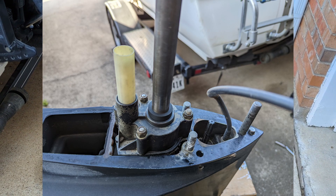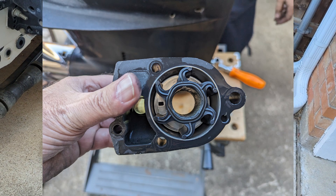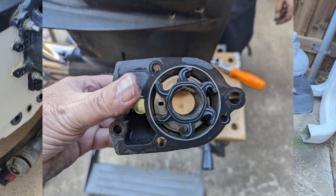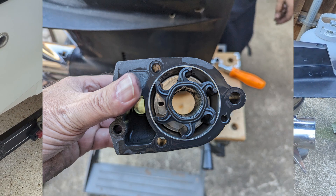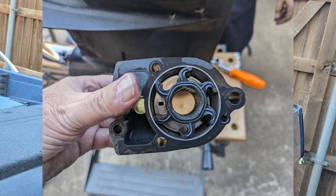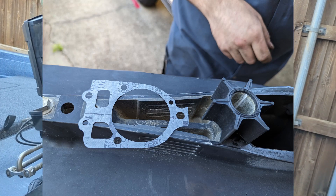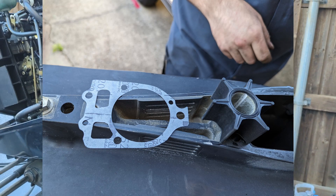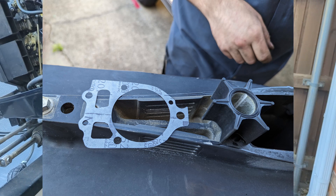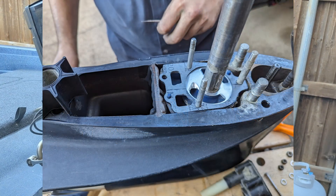After that you just pull it up and you'll see the direction of the old impeller. In my case this time it stayed in the cap — slide that off. Then there'll be a washer material, it's almost like cardboard — not being a mechanic — and then there's a metal plate and then another cardboard-type washer. You just lift those out and put new ones in.